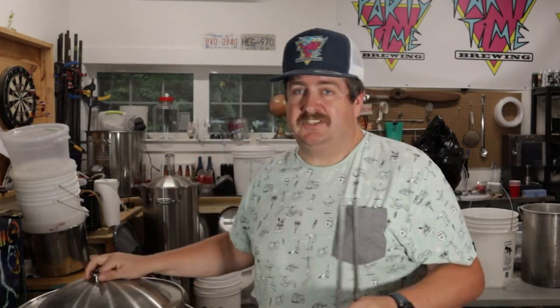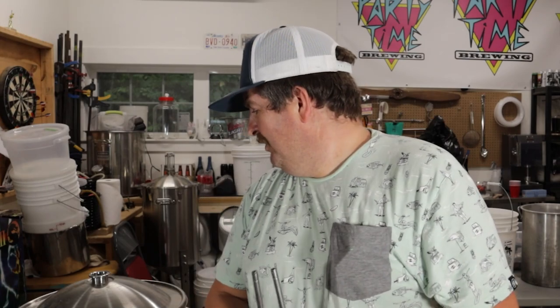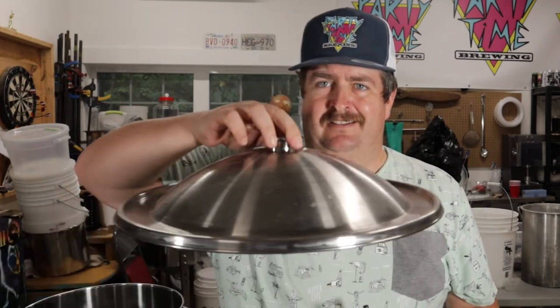We're just going to install this on the SF70. It's going to use pretty much all of the length, and we're just going to put it into the top. The only thing you really need with this, if you're not cutting it, is a pipe bender. Really all I want to do is bend it so that it fits kind of flush with the angle of the domed lid. I just want it basically as perpendicular as possible to the lid so that the pipes will go through as straight as possible. The bulkhead fittings that come with this temp twister coil will fit nice and flush. So let's get at it.